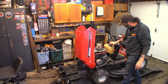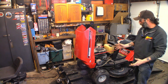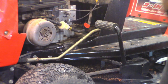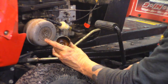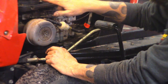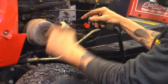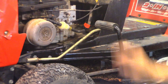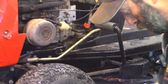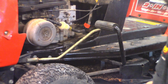We'll get it lifted up. Because the gas tank is bone dry, now is the time to put our shutoff valve and a filter in it. New filter — that's what we'll do. I've jumped ahead just a few steps already. Fuel valve's in, fuel filter's in. Got the carburetor bowl off — that's a mess. Carburetor's coming off, into the ultrasonic cleaner. I also checked with my flashlight up inside that engine cover to see if there was any mouse nest and I didn't see anything. I put a new spark plug in it. I'm not sure why it's not firing at all. I did get some of this mess out of the carb bowl, but I don't see any water in it. It could be that the carburetor is just not pulling fuel up. That's our next step — let's get that carburetor off.